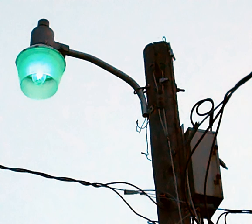There have been documented cases of lamps being damaged in gymnasiums by balls striking the lamps, resulting in sunburns and eye inflammation from shortwave ultraviolet radiation. When used in locations like gyms, the fixture should contain a strong outer guard or an outer lens to protect the lamp's outer bulb. Also, special safety lamps are made that will deliberately burn out if the outer glass is broken. This is usually achieved by using a thin carbon strip, which will burn up in the presence of air, to connect one of the electrodes.